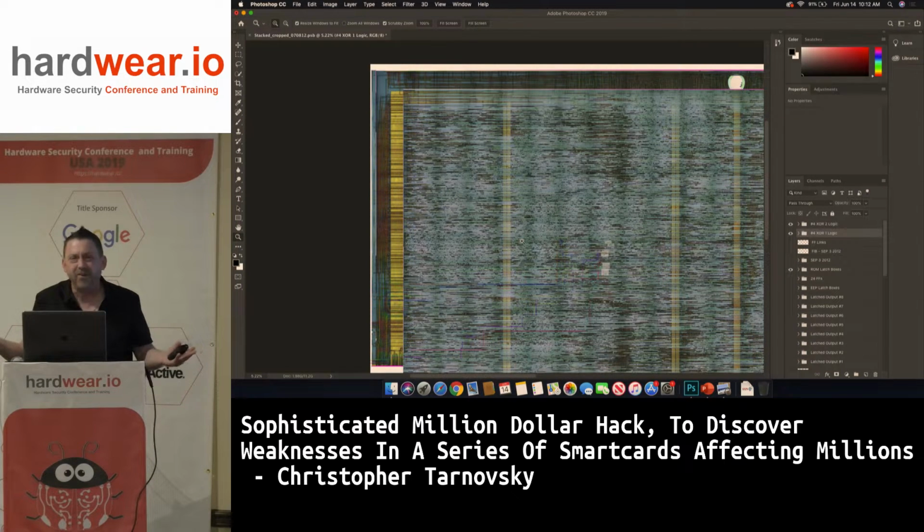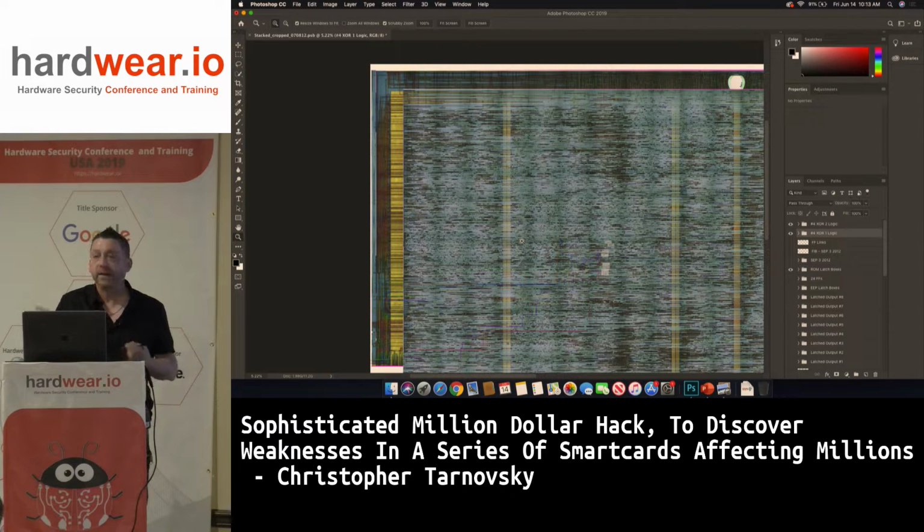We could do a glitch. So we could modify some instruction to maybe be a loop that reads EEPROM out and sends it out the ISO 7816 data port, which is a UART built into the chip. So maybe it's going to read EEPROM and send a byte out to the outside world. So I could glitch that with a needle.